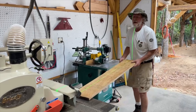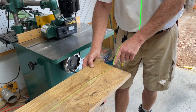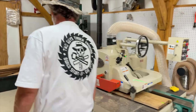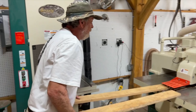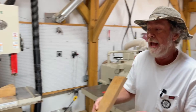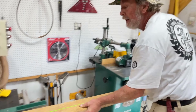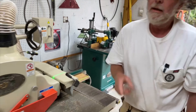I'm going to put my board up on the laser right there where that crack is, and wherever this laser is hitting I'm going to line up right here — that's where that board is going to be cut. Crack cut perfectly out. Now that board is not straight yet, so I come back and set the depth I'm going to cut. This looks like it's going to be a four-inch piece. I run my cut edge directly against here once the feed takes over. Perfectly straight.